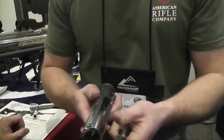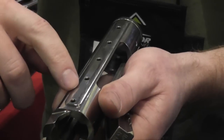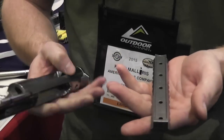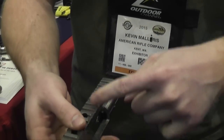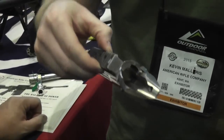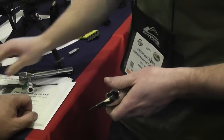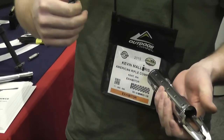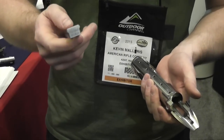For your rail mount, we have a tapered key. It's cut into the top of the receiver, so there's a two-degree taper on each side, and then a corresponding taper slot on the underside of the rail. So you butt up against these hard stops here, and then when you draw it down with these bolts — these are off-the-shelf bolts — it's an interference fit. I just did that quick squeeze by hand. It takes a little work. If we were to pull the bolts out, you're not going to be able to get that out by hand. That's as rock solid as an integral rail, but it allows you to change the inclination.